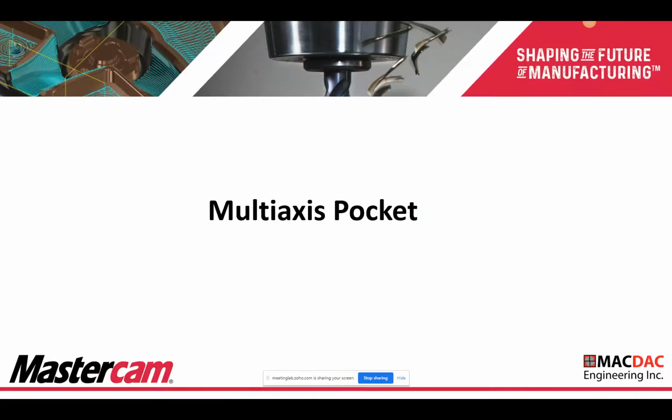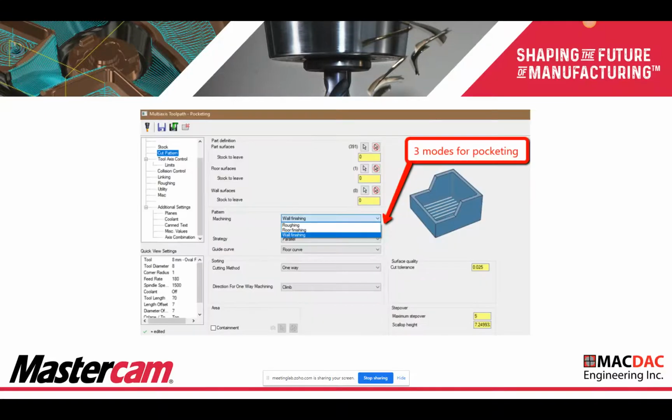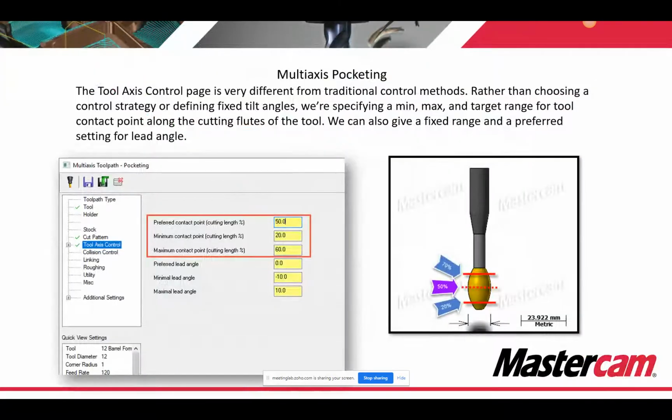All right, another new toolpath here. We got Multiaxis Pocket. So just like its name, it's a multi-axis pocketing toolpath. But I think the coolest thing about this toolpath is the floor finishing and wall finishing. So you have a different tool axis control page. It's different from traditional control methods.